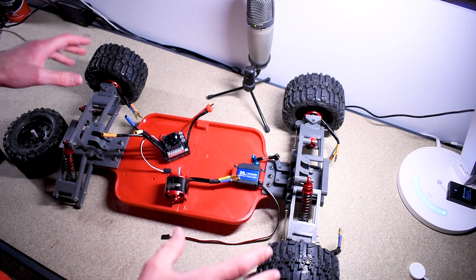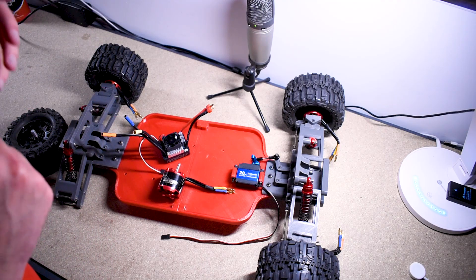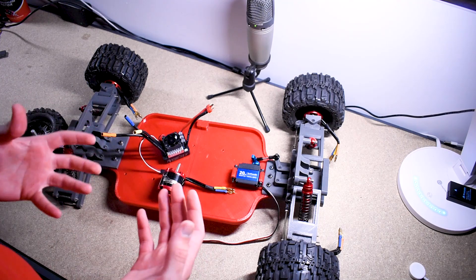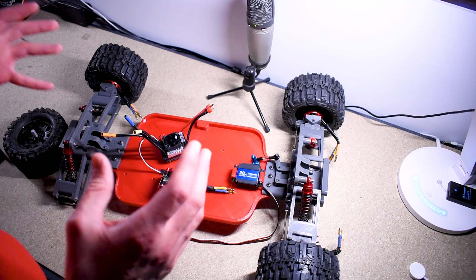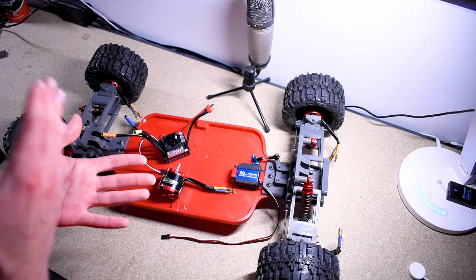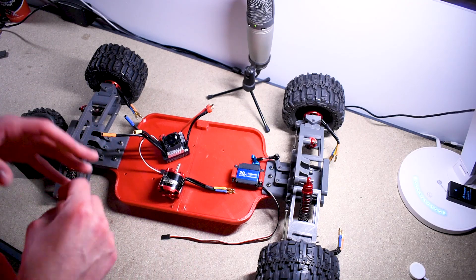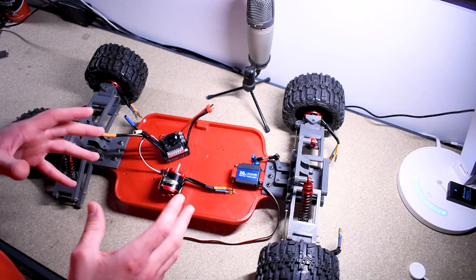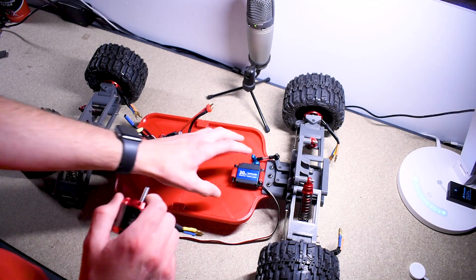I think based on what I found in the real world, if I had taken it out and blasted it at serious pace, these motors would have burnt out really quickly — at least in this current configuration. After thinking about it over the weekend, I decided it doesn't really make sense to continue with this design just for the sake of completing this version of the car. So I'm going to pivot and go straight to Raptor 2, incorporating everything I've learned, including adding gearing and placing the motors up on the chassis.